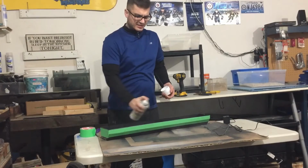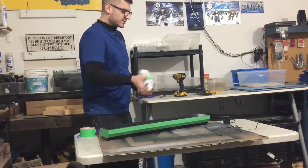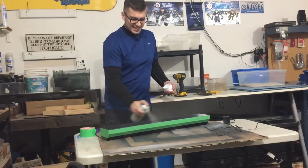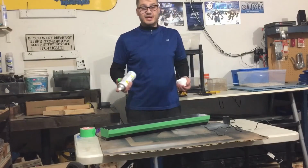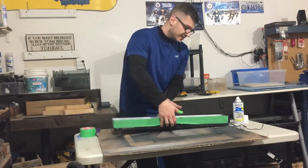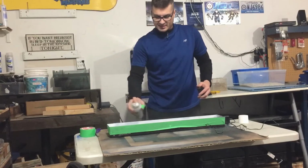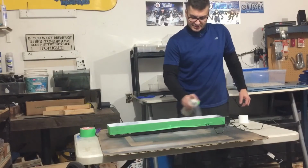When I use spray paint, I like to keep the can moving at all times. And I don't like to press the button down for too long at one time either. That way it goes on slow and steady, and it doesn't cake on or drip too badly. Realistically, it doesn't matter that much because this fixture will be facing downward, but it's just good practice to try to do a good job. Eventually, it will matter when you're painting, so that's why.